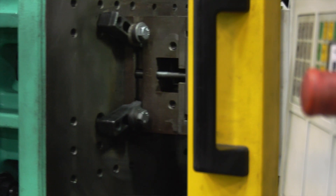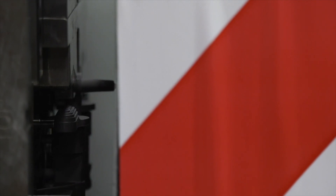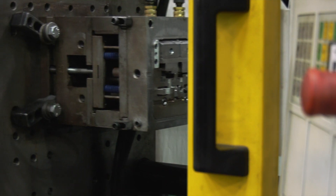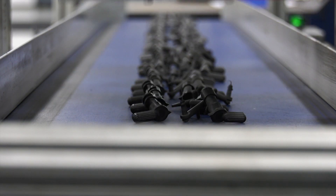The feedstock goes into cavities in the molding machines. Those cavities can be a single cavity, or if you're doing high-volume components, maybe 20 to 30 cavities — so as one shot goes through the molding machine, you can make that multiple number of components.